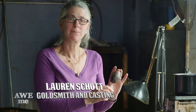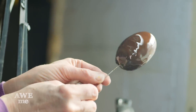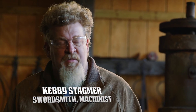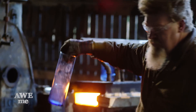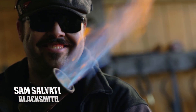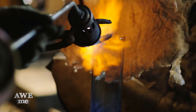I formed an egg shape for Loki out of wax. And now I'm going to dip into hot wax to put a smooth coating over. What we're doing is creating a mold, and then we'll put glass into the mold. We're going to take some found glass that we actually purchased just from a Goodwill. We're preheating it on top of the forge. It's cracking a little bit, but we're going to slump it in on itself rather than just smash it. We'll have a little bit less air trapped when we do the slump into the mold itself. So it's already starting to slump a little bit. I'm just pushing it in on itself to get a little bit of safety for us.